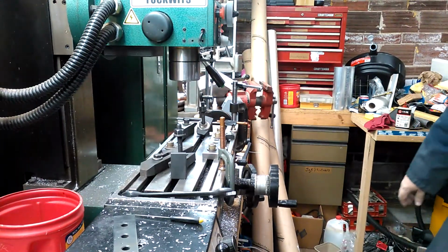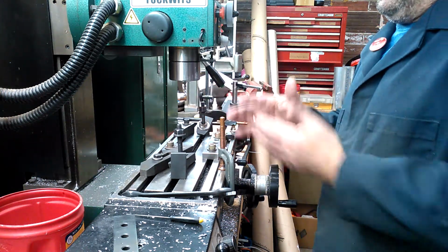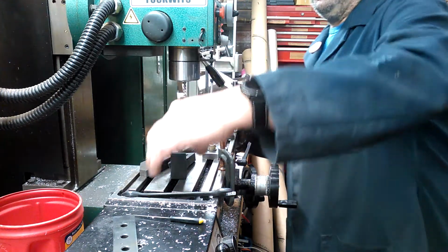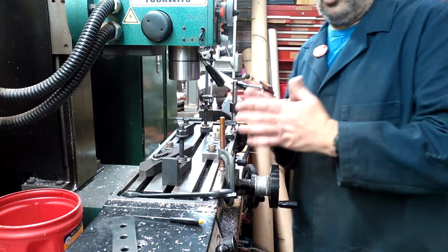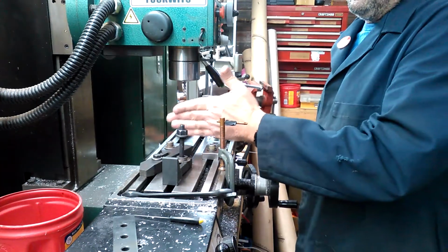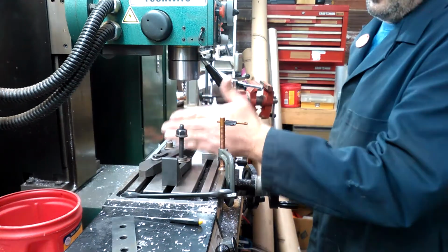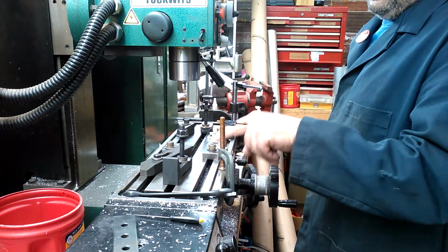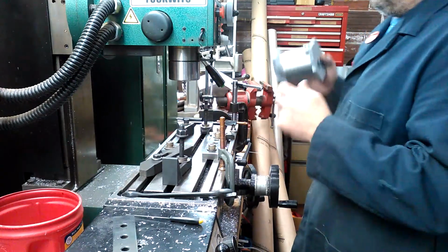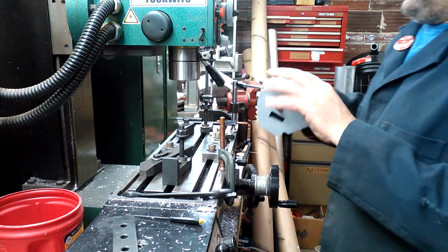This is bearskins and stone knives machining, okay? Very convoluted setup, but it does work. I've done numerous pieces on here, and so far I've not really had a problem. I have an end stop here so that my piece cannot slide forward, and an end stop here so it cannot slide backward. An edge block or parallel bar here so I can align this way, and then two pieces back here that catch it on these weird angles so that it kind of locates it.